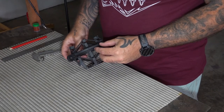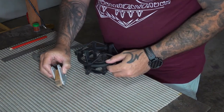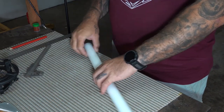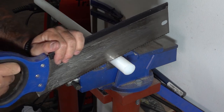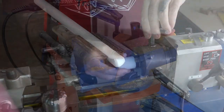This is the shock mount I'm going to be using — I've had this particular one for a number of years. The mounting tab is way too thin and is definitely not going to fit, so I'm going to have to turn a couple of spacers or washers to fill that gap. I think this material is called Delrin. It is fairly inexpensive and it is very easy to turn on the lathe.